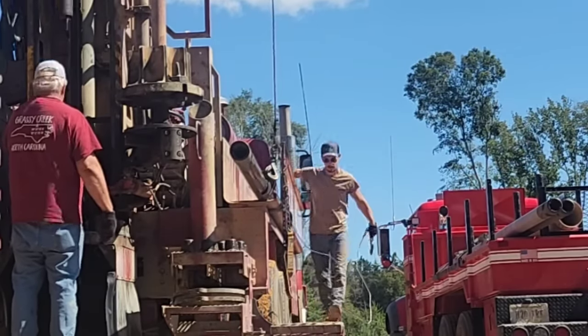All right, we are back at the house. I've got my water line underneath the footer, underneath the foundation with a 90 glued onto it. I'm gonna go inside now and glue on my riser pipe. All right, let's go see what we got. There we are, nice and simple. Well, unfortunately, my light just died, but I've got just enough daylight under here that I can work without having to go get another battery.